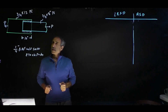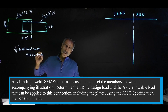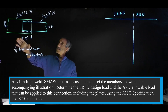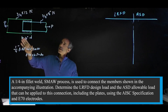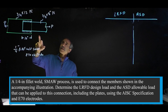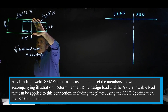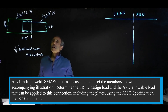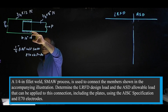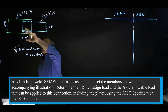Hello and welcome back. In this lecture we want to talk about the strength of weld. We've got this simple problem here — two plates. The first plate is 3/8 by 12 inch and the second plate is 3/8 thick by 8 inch. This is 8 inch and this is 12 inch, and the small plate is welded at 10 inch on each side to the bigger plate.